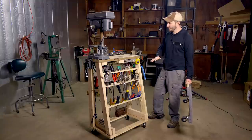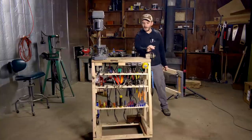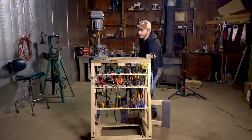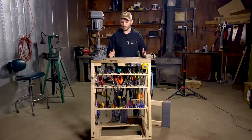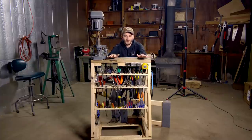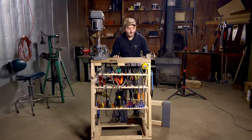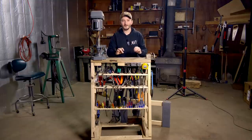That was part of my purpose for this project, but I had an additional purpose: to make this platform a useful device for producing my videos. Part of the purpose was to have a tabletop surface — a little miniature workbench that I could use for filming. I built this at a height where when I'm sitting down, the camera can be close up and framed on a small project while I can still get my face in frame.